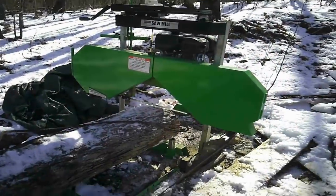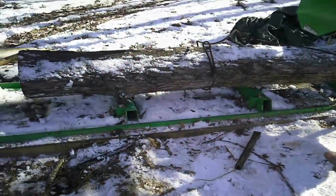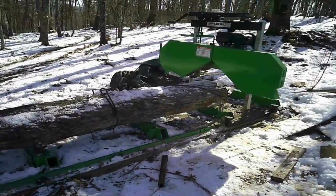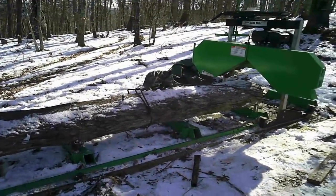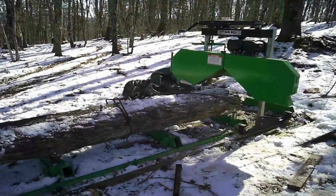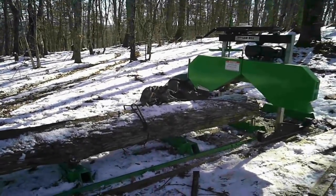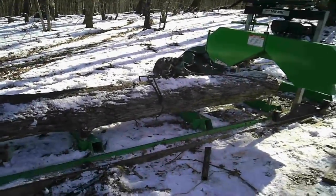It's the sawmill. One of the important things I learned on these, as you can see, build a platform for it. Originally, when I set this up, I had flattened out the ground really well and leveled it up and it was okay, but it settled pretty quickly and became a nightmare because as you're cutting along, it had a hump in it, and I was getting like a quarter inch hump into my boards, which when you get to the planing stage, yeah, it's a problem.